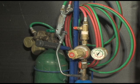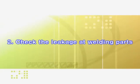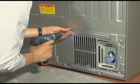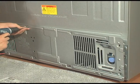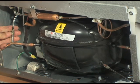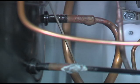Using the oxygen welding machine, check the leakage at welding parts. I'll explain the check order for leakage of welding parts. Remove the cover of the machine room and check the oil state — whether oil is inside the machine room or not. Leakage could be a primary root cause if oil leaks at the welding parts, such as the compressor sealing pipe or suction pipe.